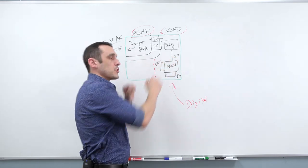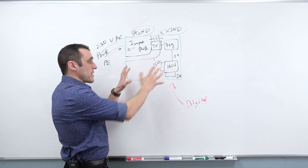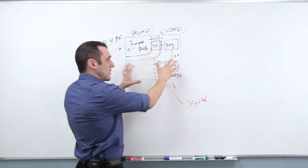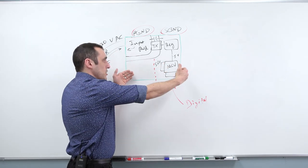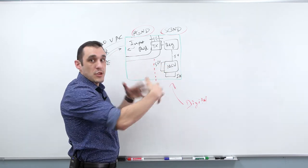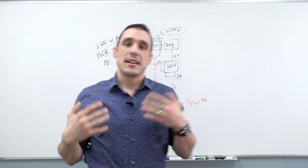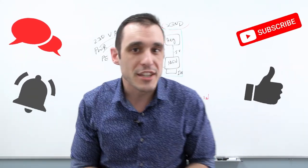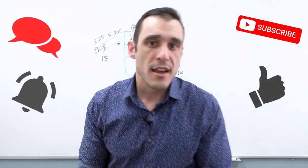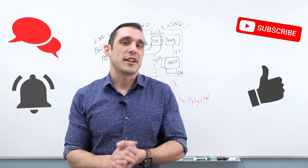A big part of it is what happens on the secondary side — the area where you might mix analog and digital stuff in their own sections above the ground plane — but you keep that ground plane solid. That way these components can interact with each other the way you need them to, to produce your functionality without routing over any big gaps that would create an EMI problem. If you liked this video, hit that like button, hit the subscribe button, leave your comments and questions below, check out the blogs in the description, and don't forget to call your fabricator folks.